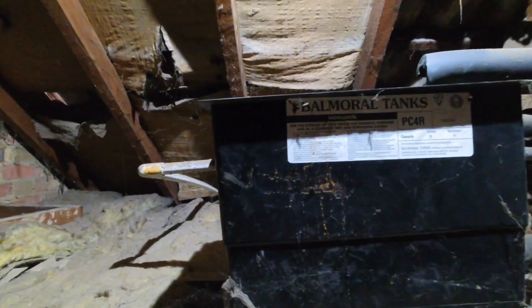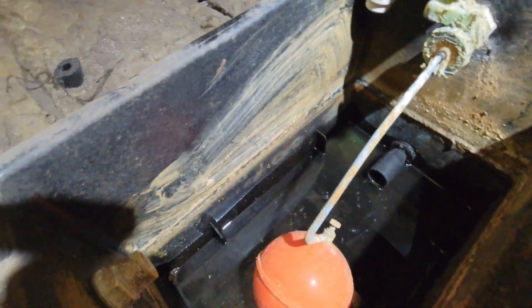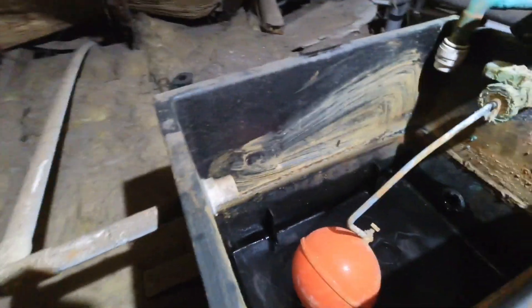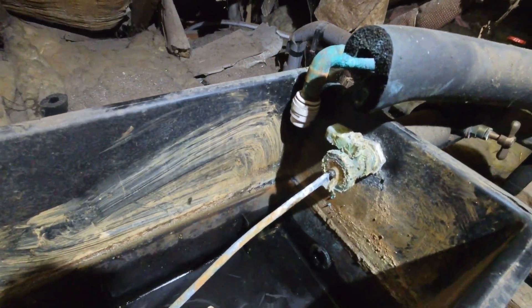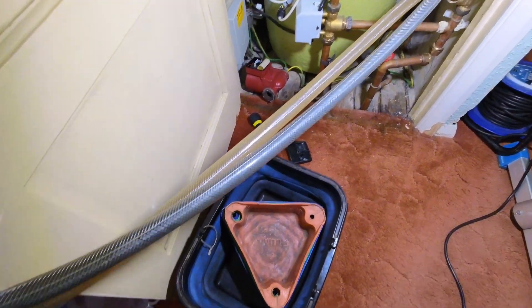I've had a bit of a clear up and I'm about to give the F&E tank a clean as well. This CL1700 is wicked for this sort of stuff. You can see it's fairly dirty in there. I'm going to get the wet vac first and try to suck up as much of that. I've also got my Karcher pressure washer to blast in there and give it a proper clean. The wet vac actually did the job - that's all sucked out of there, nice and clean. I'm going to chuck some inhibitor in there first so when it starts to refill, the inhibitor will go in. That is pretty bad - all of them have been like this, so I'm hoping we'll have a good catch by the end of it.